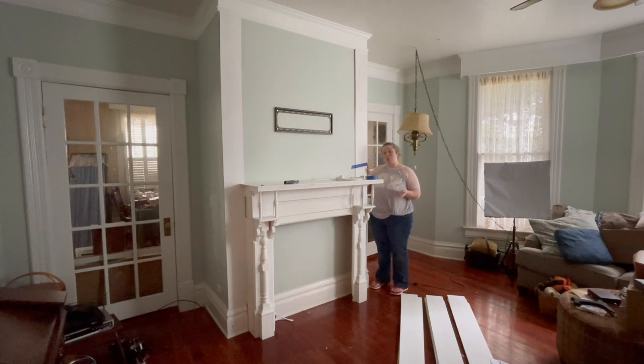Now, if you buy actual shiplap, and different hardware stores have it ready to go, it has tongue and groove, kind of fits together, so you don't have to use quarters for spacers. We actually have some other little blind samples, because mom wants to get blinds in here that she thinks will be easier to use. The main goal is to get something that's about a quarter diameter thickness that you have multiples of. That way it'll be the same distance all the way across.